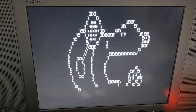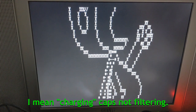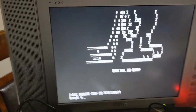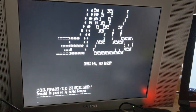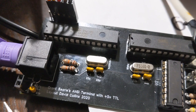Talking to someone on Facebook forums — the filter capacitors in the original design are 22 picofarad, and that might actually be slightly too low. The trouble is, I don't have data sheets for my crystals, so I can't do the math. I'm probably going to get actual data sheets for these.